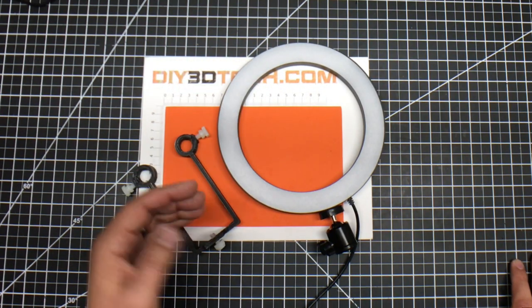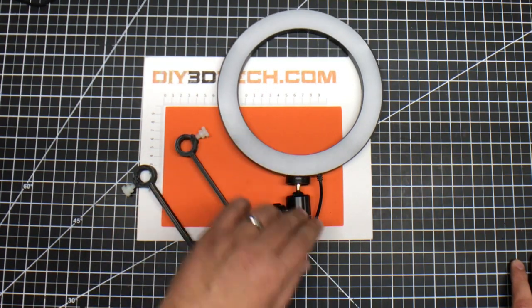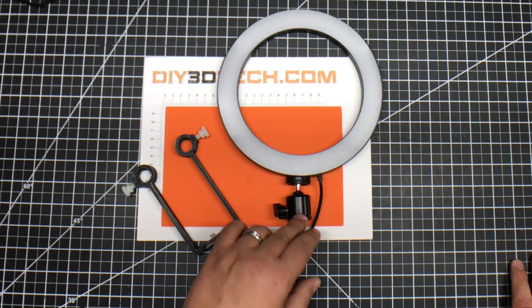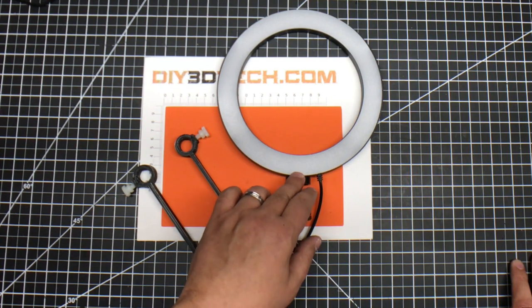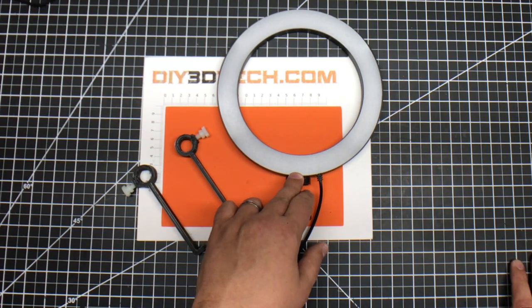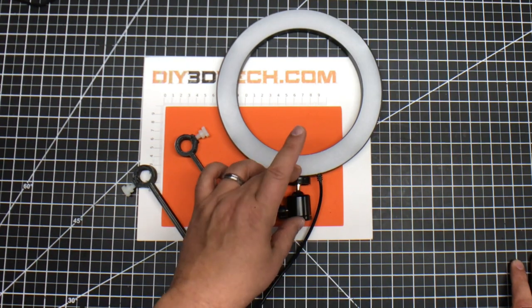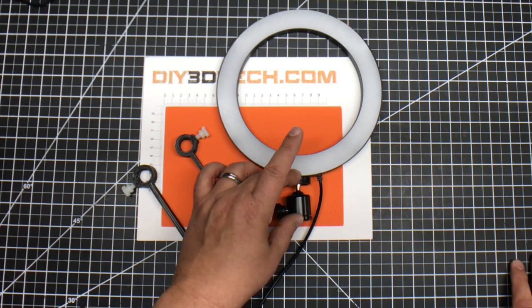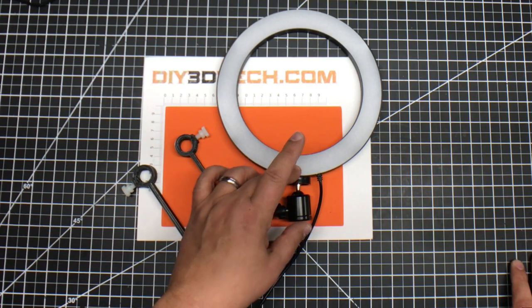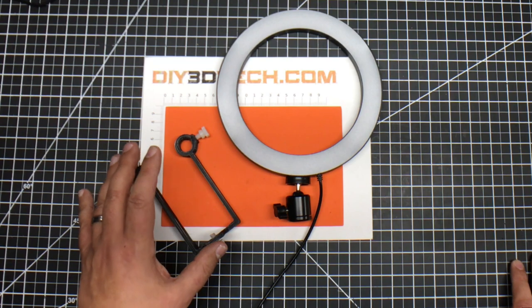To do that, I needed to come from the bottom up because, as you notice, it has a ball head tripod adapter down here. I could have mounted it directly to the ring — it does have a 1/4-20 bolt up here — but I like to have a little more finite adjustment. So I had to pick up about 50 extra millimeters here to accomplish that, and I took that into account in my design.